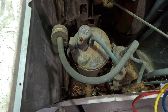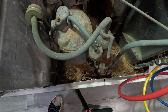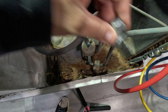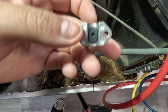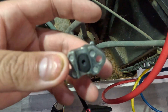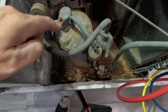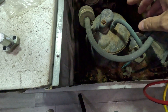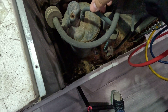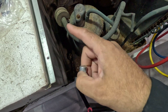This is your suction line, which is the cold pipe, and this is your hot pipe. Everyone wants to check their high-side pressure too. But you cannot put the line tap on the hot side — this gasket will actually melt and you'll get a leak. You can only put these line tap valves or piercing valves on the suction side — the cold pipe. Keep in mind: the big pipe will be your suction or cold pipe, and the smaller pipe will be your discharge.